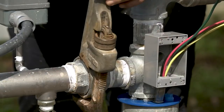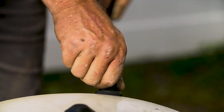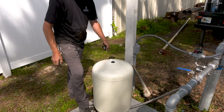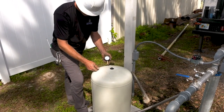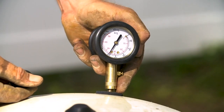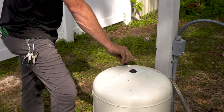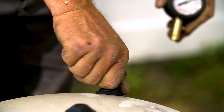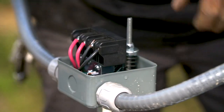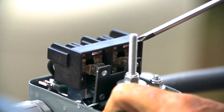When the pump is secure, a new pressure tank should be added to the system. Because of the SQ's soft start capabilities and ECM motor, a smaller tank can be used. This reduces the cost to the homeowner and the amount of space required for the well system. To maintain system pressure with the SQ's soft start feature, it is recommended that the tank pressure setting be approximately five PSI lower than the pressure switch cut-in setting. The pressure switch should also be examined for any signs of damage or wear and replaced if necessary.